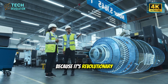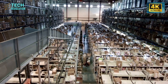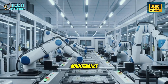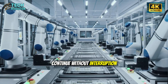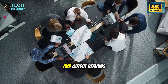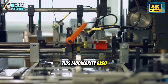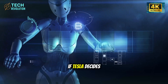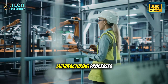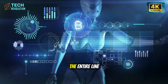The five-module independence deserves emphasis because it's revolutionary. Each module operates with buffer capacity and fault isolation. During normal production all five work simultaneously; when one needs maintenance, the other four continue without interruption. Downtime drops dramatically, production stability increases, and output remains consistent even during repairs or upgrades. This modularity also enables future expansion — if Tesla decides to integrate aluminum-ion batteries at full scale or add new manufacturing processes, they simply update specific modules rather than rebuilding the entire line.